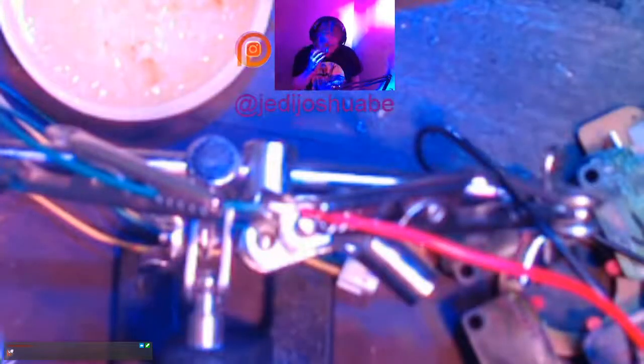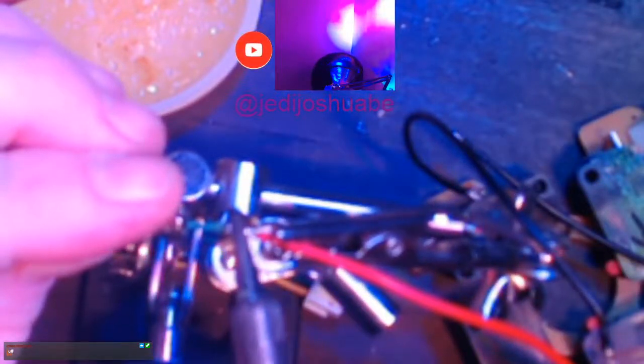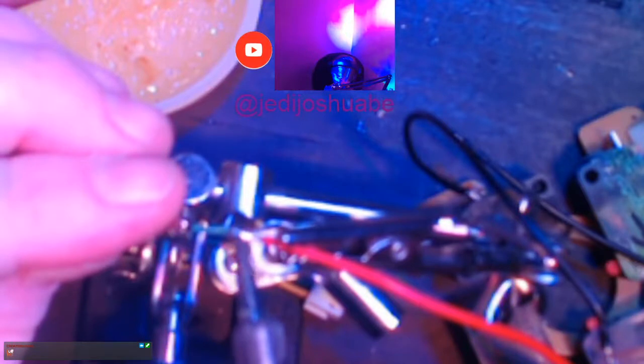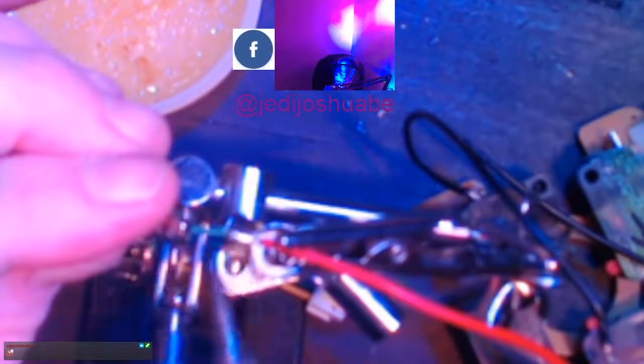So now, as you can see, I have my proper soldering platform in place. It's much easier, much cleaner, much happier with the result. And just to show you, here's some rosin, and what we want it to do is mainly run down on this green guy. So we're just putting a little bit on the green guy. All right, and we're going to bring it together. Top guy gets the warm first. Make sure you're using the hot part of your tip, and I've noticed this part of my tip is over here. And then get the other guy.